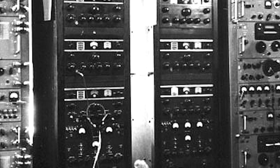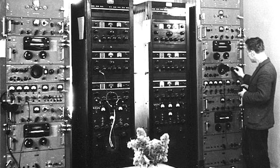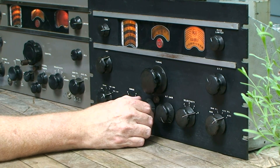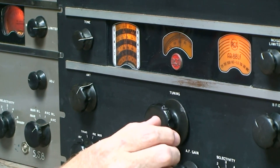The 88D is the most common of the old AR88s. There are 88s around, but not that many. There is an 88E — Echo — used in diversity reception; those receivers usually came in pairs in a rack with extra equipment. This is a time when only AM and CW were available — that's what it's built for. You can resolve sideband by adjusting the BFO and playing with the selectivity.